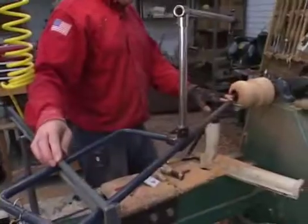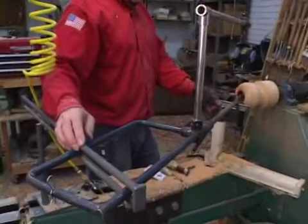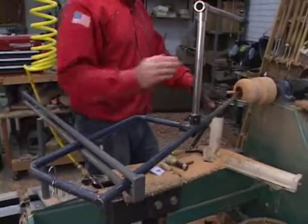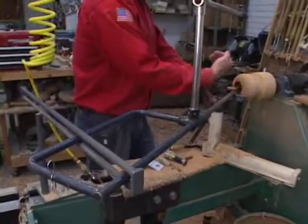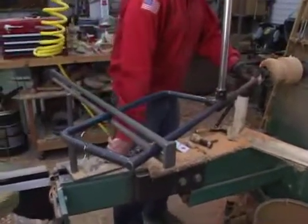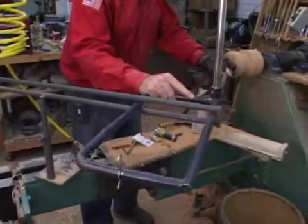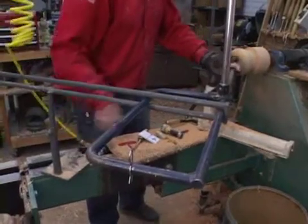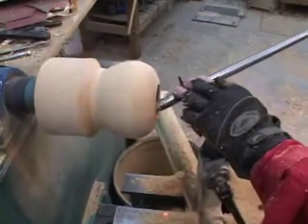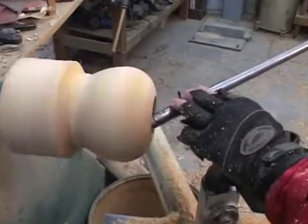I'm going in here, and I feel that my swivel isn't swiveled up around enough to make a clean cut. It's kind of stalling out on me. So I could do two things. I could swivel the swivel around further and make a cleaner cut, or watch what I can do. I can move this backrest over a little bit and watch what happens. It gives me more swing to my handle so that I can get up and undercut those shoulders easier. So we're going to watch that laser disappear, and when it's off of the surface, then I stop cutting.